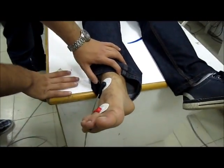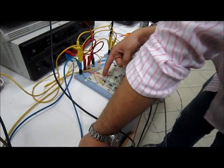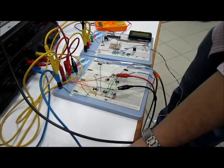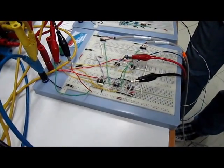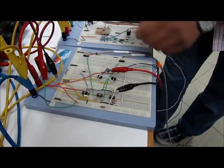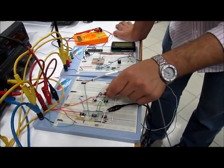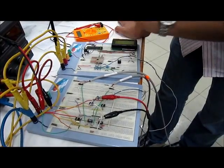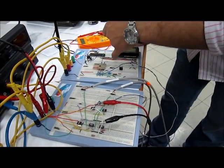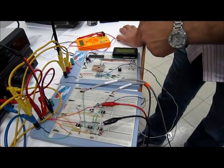This is our subject — here is Ahmed. We have to connect four electrodes: two in the right foot and two in the right hand. Let's discuss a little about our sensor. We have here the Howland circuit, also called the voltage-controlled current source. Those two are instrumentation amplifiers to amplify the signal from the subject. These are the electrodes connected to the subject, connected directly to the instrumentation amplifier. And these two buffers match the impedance between the instrumentation amplifier stage and the next stage, which is the phase and gain detector.